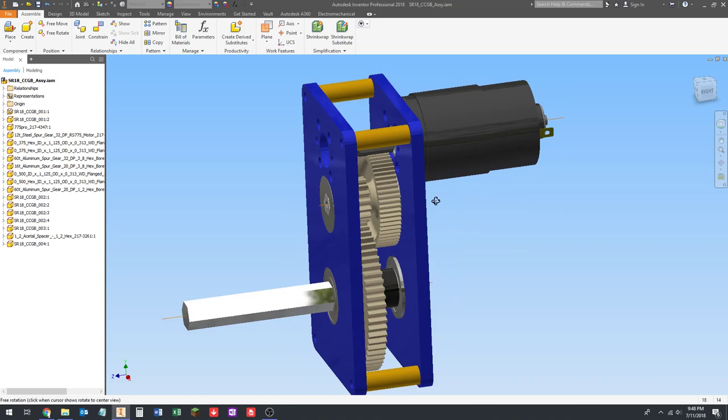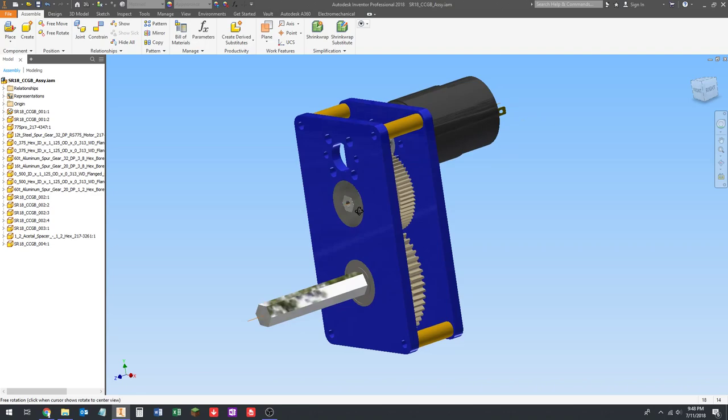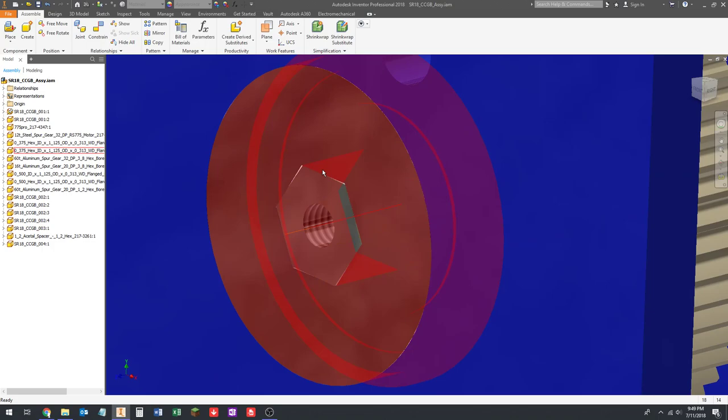Okay, so we need half inch long 10-32 button heads up here, 3/8 long 10-32 button heads down here, and on the other side, a number 10 washer. We need to check that the diameter of the washer is larger than 3/8 of an inch, because we need it to extend. It doesn't have to be huge, it just needs to barely be beyond the hex.